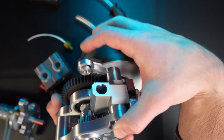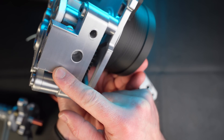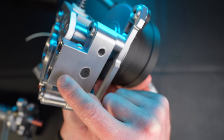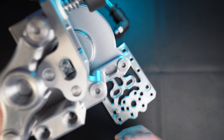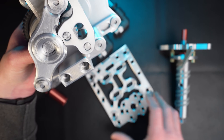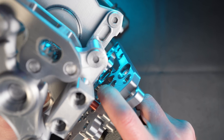We can either keep it air cooled, or there's gonna be a version that is water cooled — there's gonna be a water pass inside, it's gonna go all the way up to here and all the way up to here, and then another pass right here, so it's gonna flow like that. It's gonna keep that heat brake very cool. Even the air cool version should be just enough without any fan.